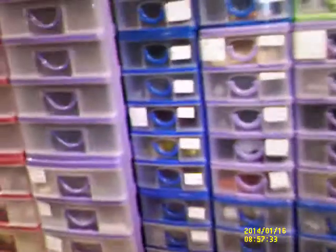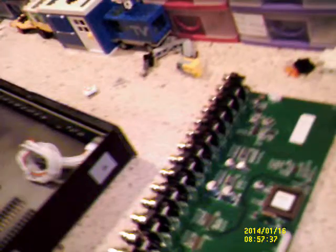I think the sockets here are — from the look of it, yeah, they're through-hole. But all the little electronic doodads — all the resistors and capacitors and diodes and whatnot — are all surface mount, except one, and that's that big silver one here. The rest is all surface mount, and that's a double-sided board as well.